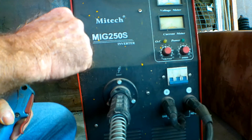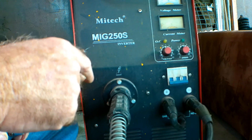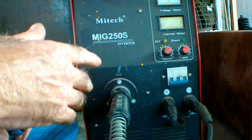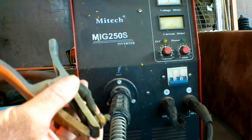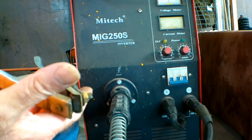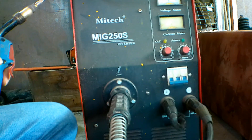And it makes a huge difference to your welding. If you've got your electrode on positive, all the heat is basically generated on the end of your wire — it's just going to burn, splatter, spit, and do all sorts of horrible stuff. But if you change it so the power goes through your earth clamp instead, what it's doing is heating up the work that you're welding onto, and then you're putting the weld on top of it.